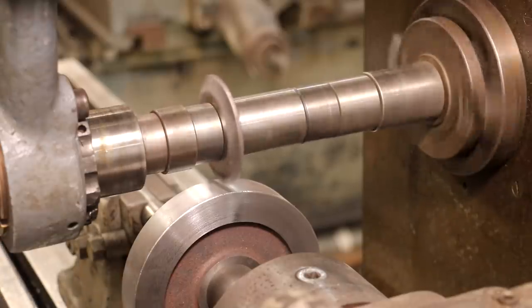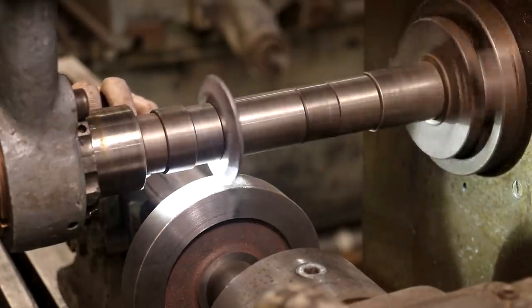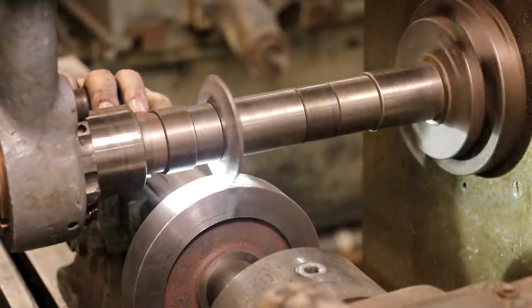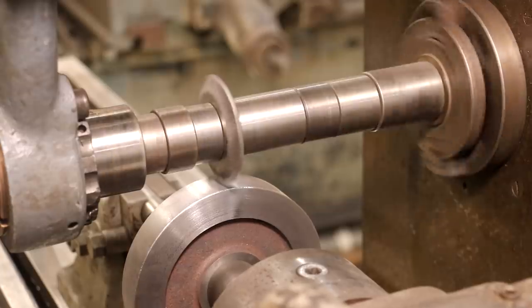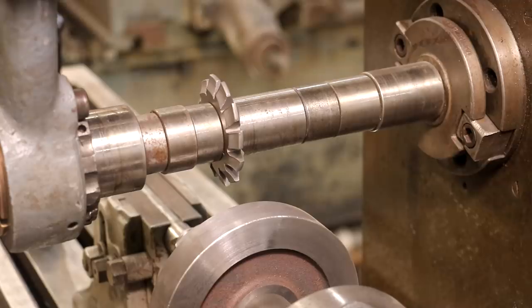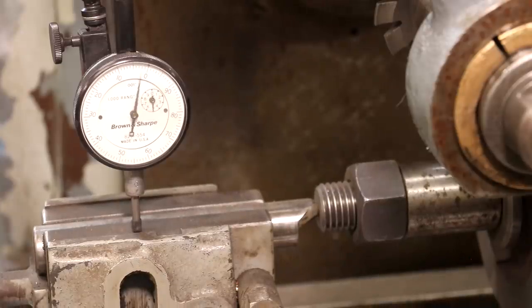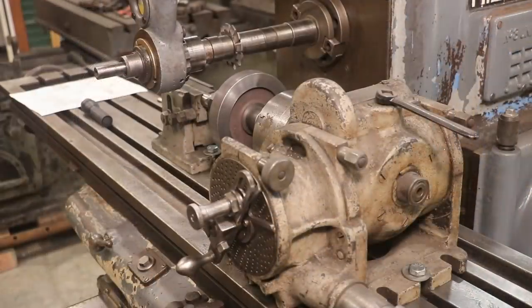I'm going to raise this table up until we touch off — just slowly raising it a few thousandths at a time until I see a chip. I actually heard it right there; it's just barely touching on one tooth. So that is what I'll call zero. I'll come off the cut and then, using a dial indicator, raise the table up 200 thousandths — two revolutions on the dial. That's at 200 thousandths right here and I'm going to tighten my table. That should be right on 200 thousandths for our first step. Should have 75 more after this first round.